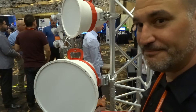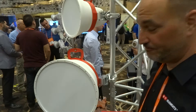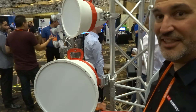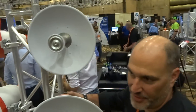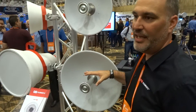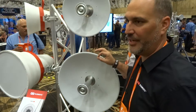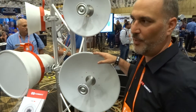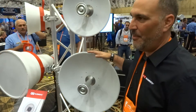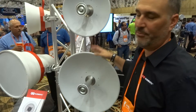Having that carabiner hook is great, especially since you don't have to detach it — you can leave it connected the whole time so if you drop the dish, your lanyard holds it where it's supposed to be. We've also relaunched our Ultra Dish — our answer to the parabolic antenna form factor. We've done some new shaping, new feed design, and it's wideband now: 5.1 to 5.9 GHz, so you get the whole spectrum. We've been able to suppress the side lobes slightly so you don't really need shrouds. There's only so much we can do with an antenna technology that's been around a long time, but we've done just about everything we can to give you the cleanest RF performance you're going to get on the market with a parabolic dish.